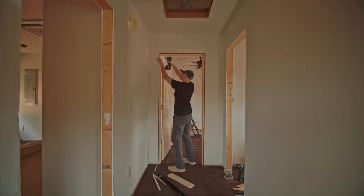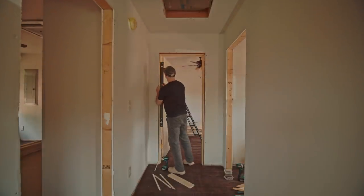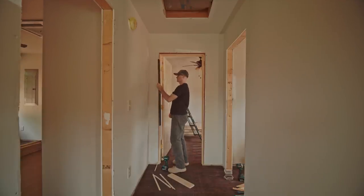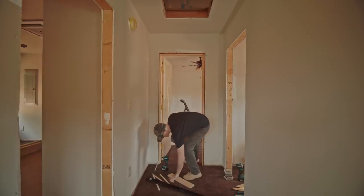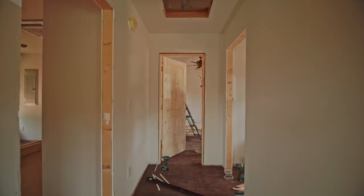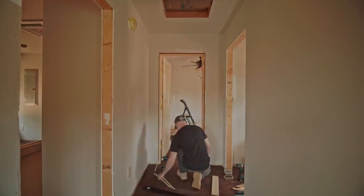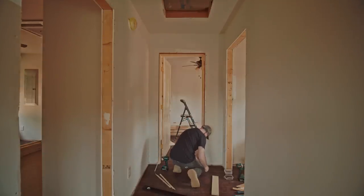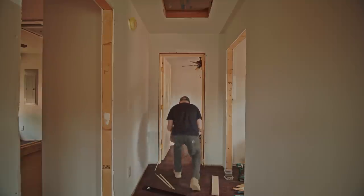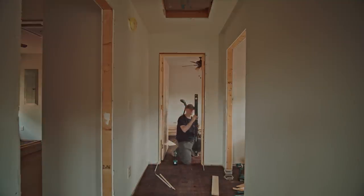My door should not float — what that means is once you open or close the door, you can leave it in the middle and it's not going to go open or close on its own, it just sits there. Everything turned out pretty good so far — I'm close enough for now. This is going to be a lot of fine tuning — that's what door installation is all about. I'm putting the door in place; if it stays, it's good. Then you can start putting shims in to make sure your door jambs are nice and solid, but be careful — if you put a shim in the wrong place you can bow out your door jamb and mess up how your door opens and closes.